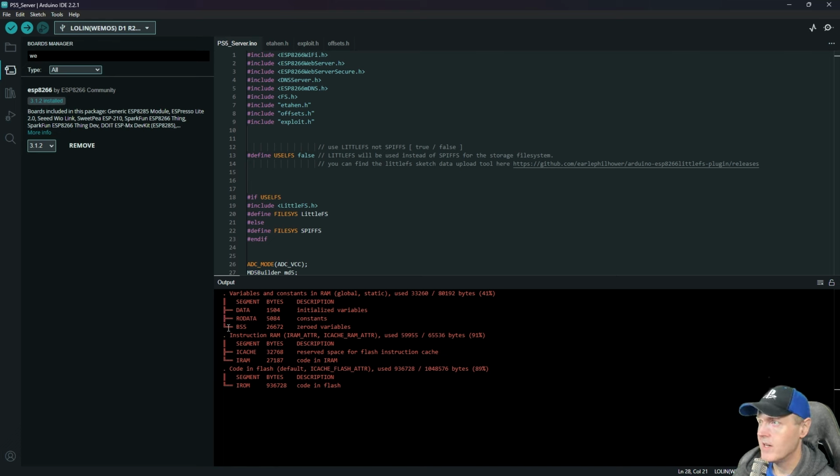So now, once we're ready, just again, make sure your ESP8266 device is plugged into your computer. Obviously, you should see this at this point. And then just press this upload button and it will upload this onto your ESP8266 device.